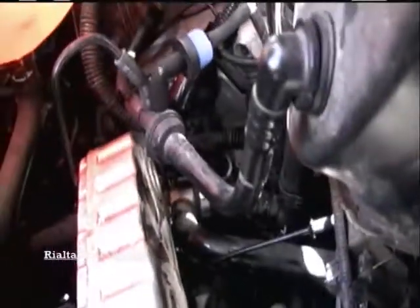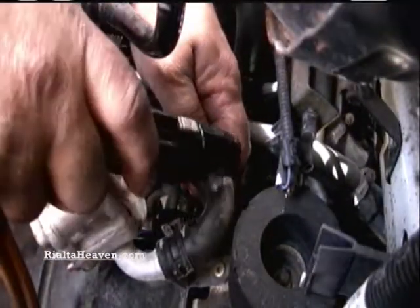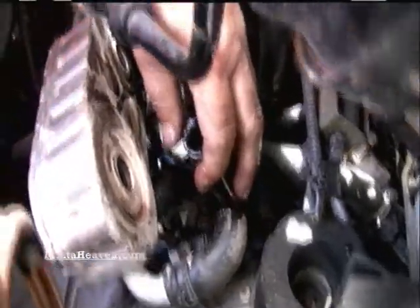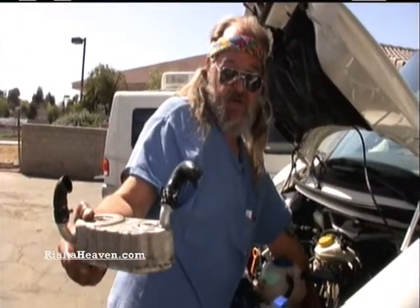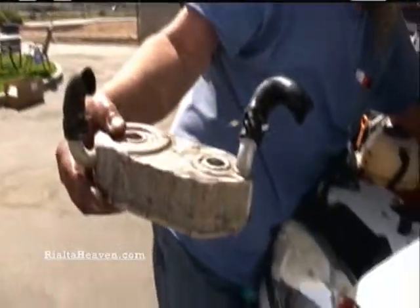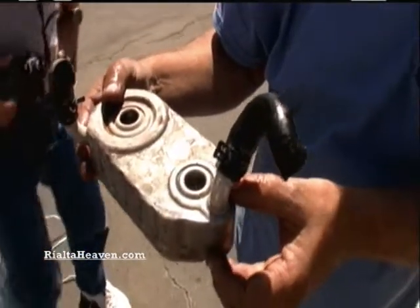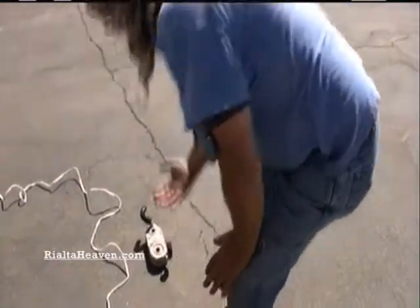This is our other hose — again you want to try to get a relatively straight piece of it. Here we have the garbage that Volkswagen puts in there. With 180-degree water going in, it's supposed to keep your transmission at less than 212 degrees — it's not much, it sure isn't, it looks like an ashtray. This is the newer one — it's a six-pass exchanger. The older ones on the 2001 and earlier Rialtas were a four-pass heat exchanger, so they didn't even have this much capacity — and it doesn't even make it.